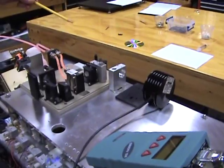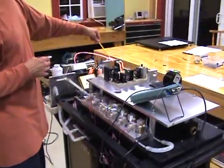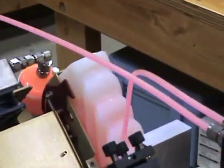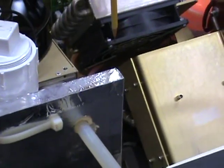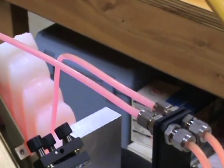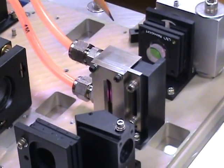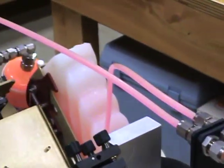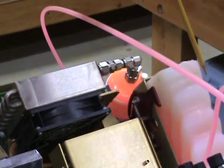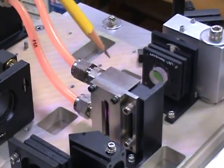The modifications haven't changed the overall layout of the laser, which is fairly straightforward. The dye solution is stored in a reservoir — about 1 liter of it — and it is drawn out by a pump that's under all of this hardware. The pump pumps the dye at a relatively high pressure, about 40 psi, to the dye cell, which consists of two quartz windows separated by a small metal spacer. Then the dye returns through a radiator to remove heat built up by the pumping process, through a particle filter, and back to the reservoir to complete the loop.